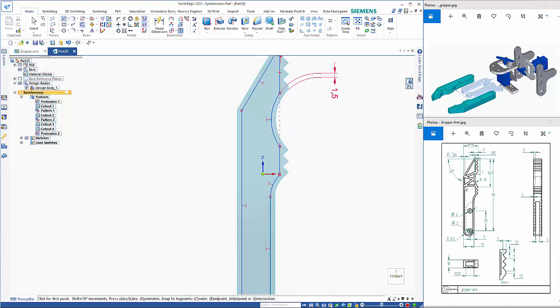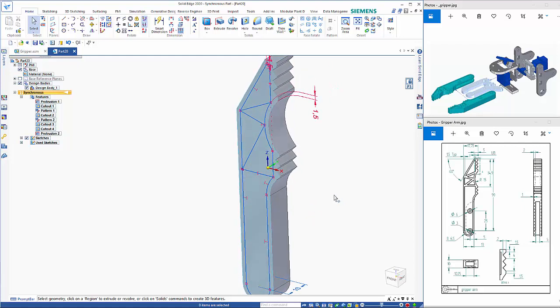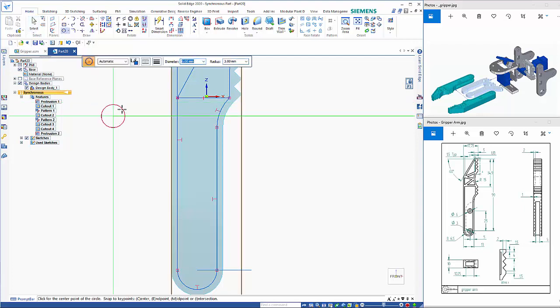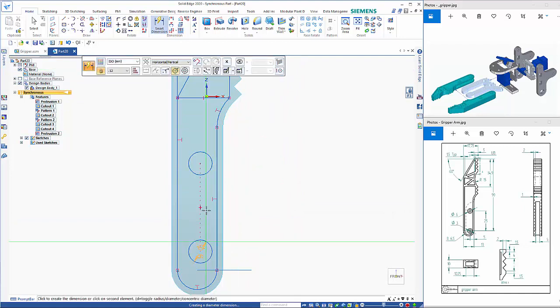So the portion here is driven off of these points here, so it just goes from there to there to there to there, like so. We've also got these 6 diameter pieces on here, so I might just add those in as well, which will cut down a little bit of work. So 6 diameter, and there's one here and one further down, so dimension those. 25 gap between them. This one's on the cut-off line, and it's 5 mm from the outside edge.